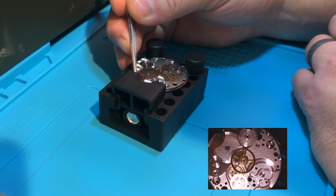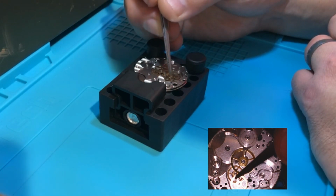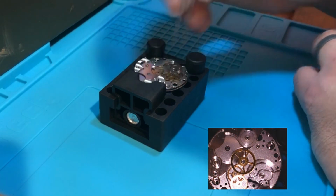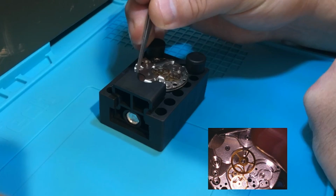Again, just spinning the barrel to make sure the wheels are all rotating. As I mentioned before, I like to do this before and after placing a new part. As you can see, the fourth wheel was making the train stick a little. This tells me I need to fiddle with it a little more before moving on.